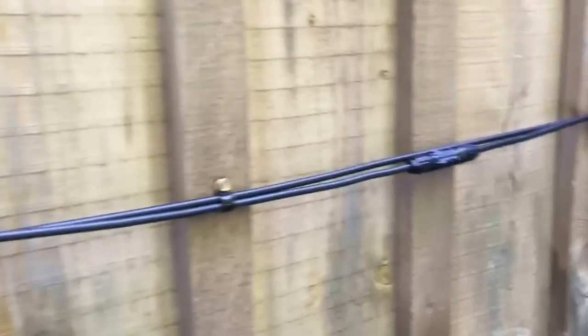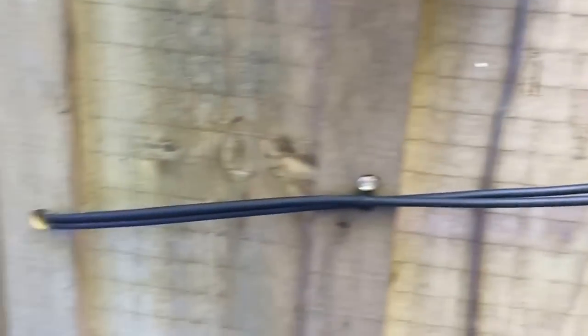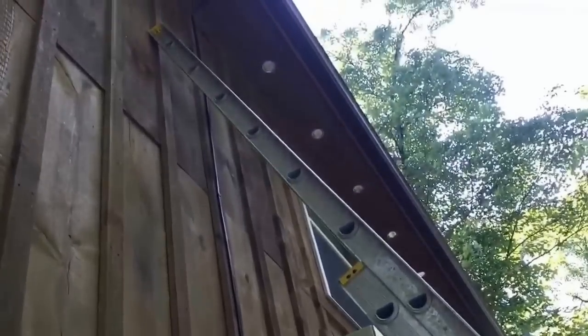We've got the wire dropped around and down the side of the structure. That's double-insulated wire with MC4 connections, going into the structure which will be siliconed — a very neat run right there directly down. We had over-voltage with the panels, but I figured by the time we made the drop into the structure we'd be right at the voltage safety limit. We're going to be under the 100-volt range by about three or four volts, so that's going to work out perfect for the customer.